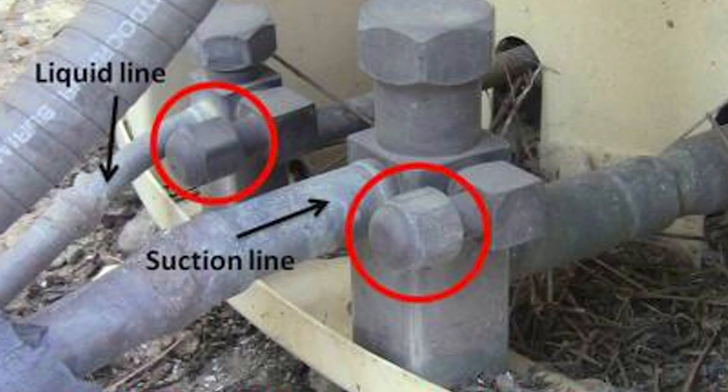If the suction line feels warm, then you probably have low refrigerant and you're going to need to call a technician to come check your freon, because you might have a leak in your coil or in one of your line sets. So again, if you go outside and your evaporator coil and filter are clean, feel that fat line. If it's cold, that's telling you most likely you have good cooling. If it's warm or lukewarm, call a technician to come look at your system.